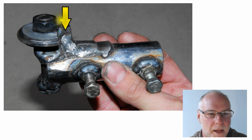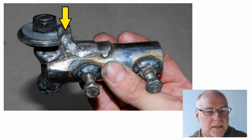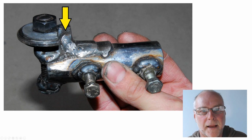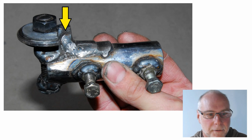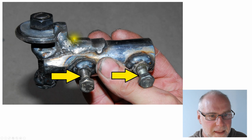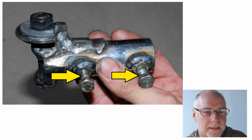And talking about deformation, we also have a brace, a bracket here at the back, which stops the whole thing from bending backwards. A lot of force is involved in this sort of a tool. We also have some nuts that we've welded to the tube and some bolts. They allow us to actually attach it to the upright of the hydraulic press. Here they are again, arrowed this time. Also note the distance between there, that face there, and this face here determines how far in from the end of the tube you actually make the bead, and that'll become clearer as we look at how it works in a moment.